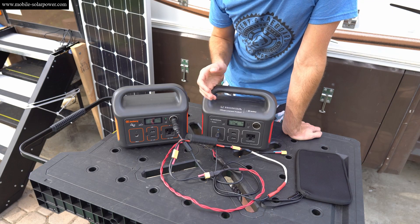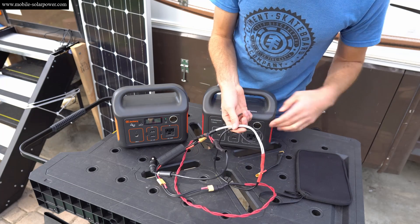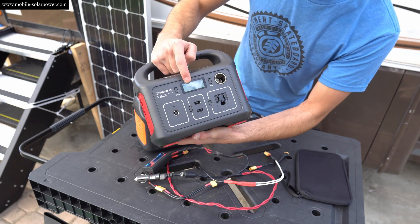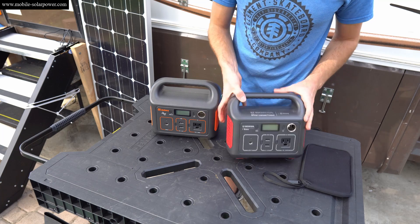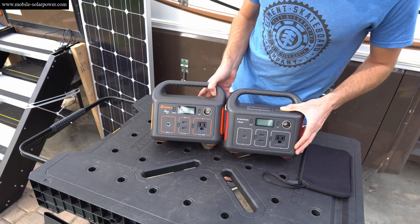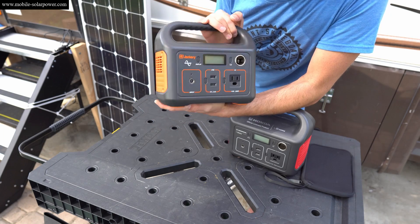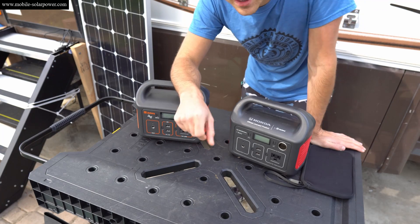I like the Jackery for most people because it's dead simple and hard to break, but I really wish it had an MPPT charge controller, that the solar panel was waterproof, and that they included MC4 adapter cables so you can plug in any 50 watt solar panel without making your own adapters. These are the only small generators that show watts in and watts out, and they're incredibly easy to use. The rated output is great, and it improves performance for 12 volt appliances compared to other solar generators. Even though I'm sponsored, I actually use this personally — it charges all my drone batteries and my micro Segway. I hope they send me the 450 watt hour model next.